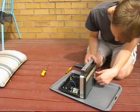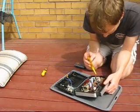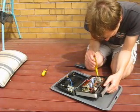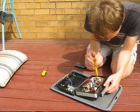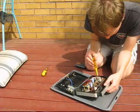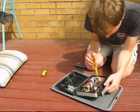We'll just find a weak signal at the top end of the broadcast band and twiddle a few controls. We'll adjust the trimmers on the back of the tuning capacitor. This one isn't doing anything, so we can exclude that. This one here made a change — notice how you can tune across. So that's the one we need.